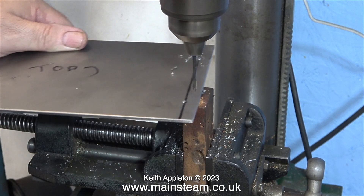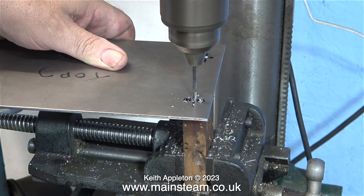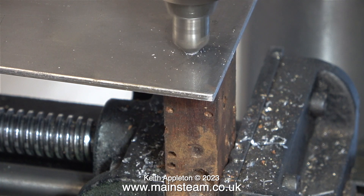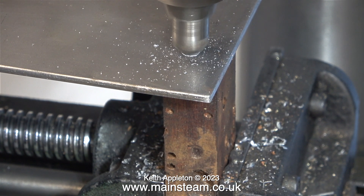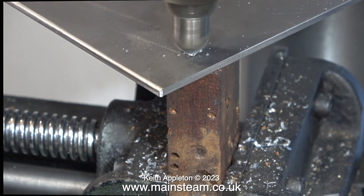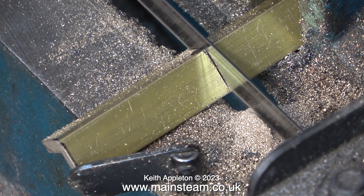With the piece of steel plate shortened, I'm now drilling the holes for the boiler. I'm currently using a 1/8th of an inch diameter twist drill, which is clearance size for 5BA. This does appear to be quite a hard piece of steel — I'm not sure why, but next time I speak to Matt at Black Gates I will ask him. Here I'm countersinking the holes, and this time they are underneath the plate. My countersink is not particularly sharp and it's raising a burr around the edge, but that's not a problem because once I've finished the drilling operations I will be using my 4 inch belt sander to roughen up the surface to key for the paint.